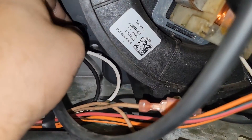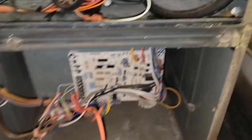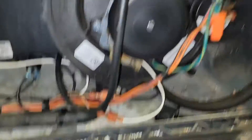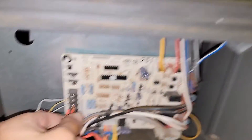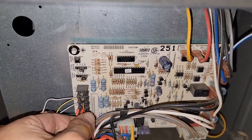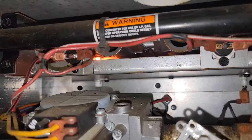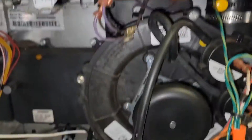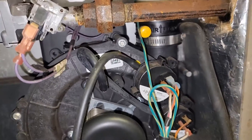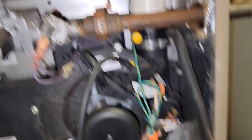Make sure it's not stopped up. Now, red to white. Still got the light — up — no more light. There we go. So I'm guessing this is filled up with water, and we got water in that tube, and that's what kept that pressure switch from closing.